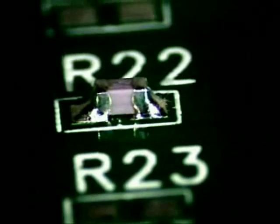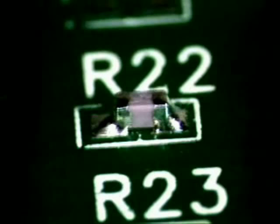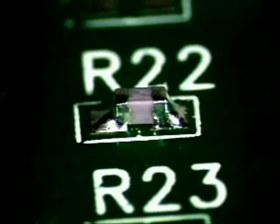If you notice with the lead-free solder it won't be as smooth and as shiny — it almost looks like a cold solder joint in appearance. But you have got nice wetting action from the edge of the pad all the way to the top of the part, with a nice contact angle.